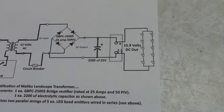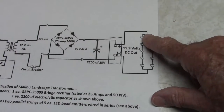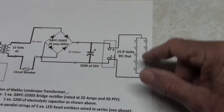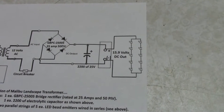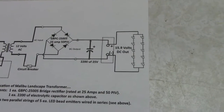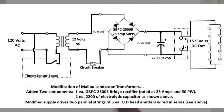Once rectified and smoothed out, it comes out around 15.9 volts. Because I'm running LEDs, I needed to string five LEDs in series. And because I wanted ten of them, I did two sets of five LEDs around my house — ten outside in two groups of five. I'll put this schematic up so you can take a screenshot of it; it calls out the part numbers I used. So that's an overview of the whole system — let's get into how I went about doing it.